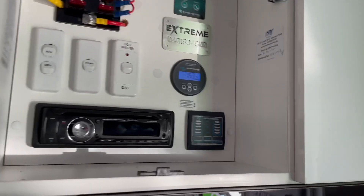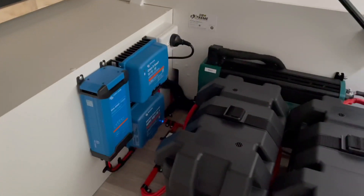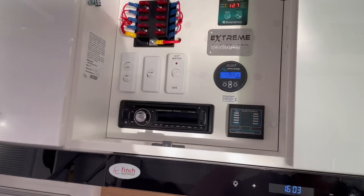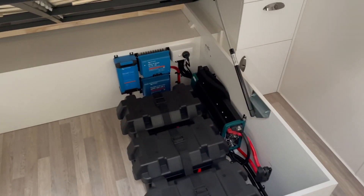JB's got some grease on them — the Viscount's got grease too. This is a 2000-watt Enerdrive inverter — that is just the 2000-watt inverter. You can see with that current draw we're pretty good. Obviously you're not going to chuck the microwave on at the same time with a 2000-watt inverter — I'm just showing you its potential. You can see it cycling up and down. Now these batteries are straight out of the box so they'll only be around 30% state of charge, and you've been running this for a while now.